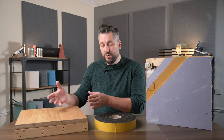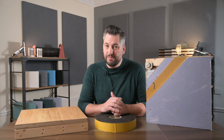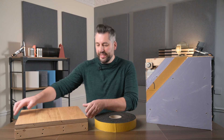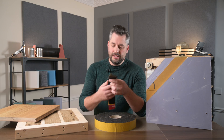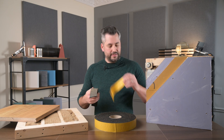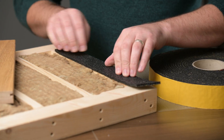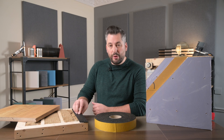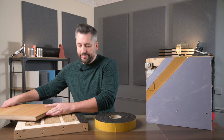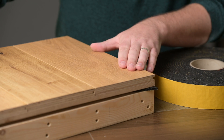If we can isolate the floorboards from the joists with something that absorbs and dampens that vibration, you're going to get a slightly better performance. What we do is take the floorboards up, take a piece of our Isolation Strip — which I've just easily cut off with a Stanley knife — peel off the backing paper to reveal the sticky side, and it sticks straight down on top of the floor joists. You'd put that down on every floor joist. There's no need to mechanically fix; it's not going anywhere once stuck down, and you lay your floorboards back on top.